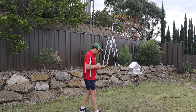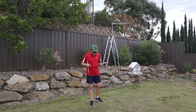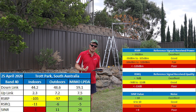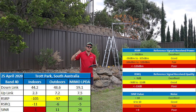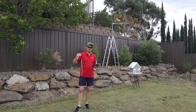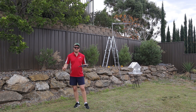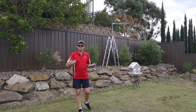There's definitely a difference. We always have to understand we're relying on network conditions, but what is super important and amazing is the RSRP — it had a significant jump, and that means you have extra buffer, extra fade margin. In microwave engineering we call that fade margin, which puts you in a much better position. If there's rain or changes in the atmosphere, you're safe from it. You're still at a strong signal, and you're in a better position than other people without an antenna. If congestion plays a role, the strongest signal gets priority, so having an excellent antenna means a more secure connection going forward.